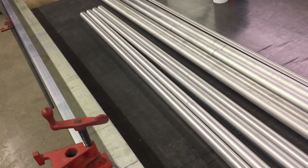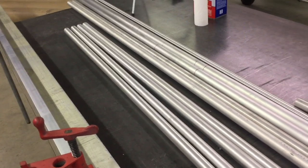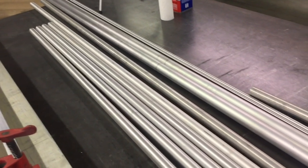I've got all my pieces cut now. These will be my four six-footers — there'll be two for the top and two for the bottom, one on each end. And then my two eight-footers that'll go into the center of the two 12-footers for the double wall.